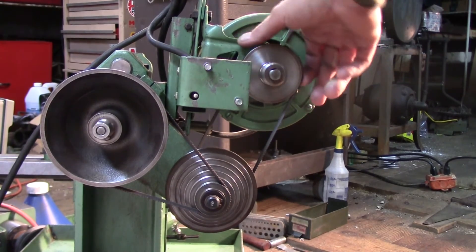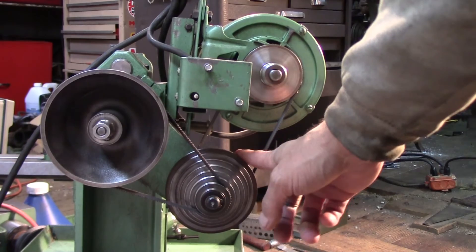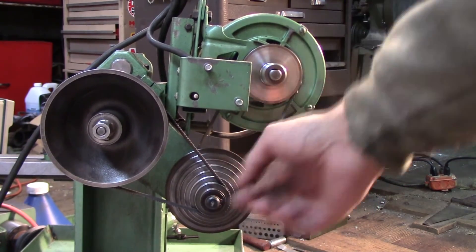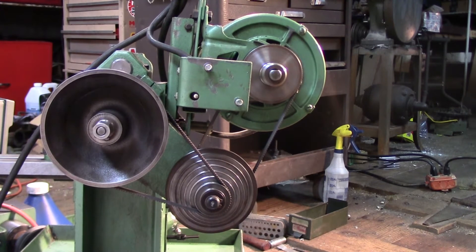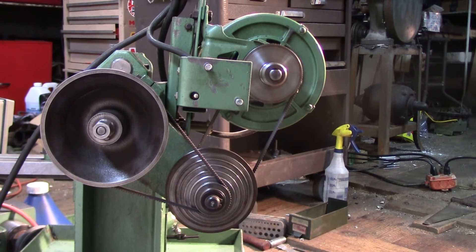Here's a look at the back of the machine. There's the motor with a single-slot drive pulley, then the countershaft pulley it drives, which feeds the pulley that drives the spindle. This is also where the drawbar for the number one Morse taper tooling goes in. It's a pretty well-designed machine — reasonably rigid for its tiny size and a good speed range for the type and size of cutters you'd run on it. This is in my shop temporarily and will probably be looking for a new home before too long, likely with someone doing model making or building small steam engines.